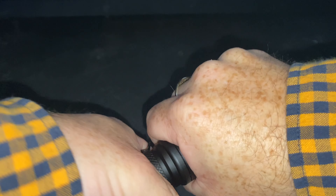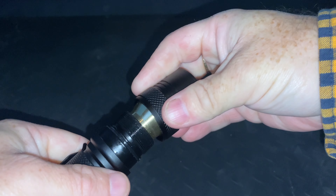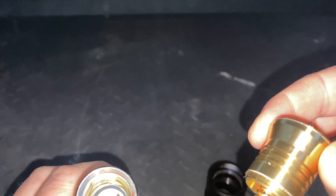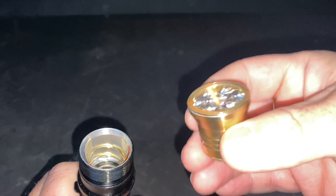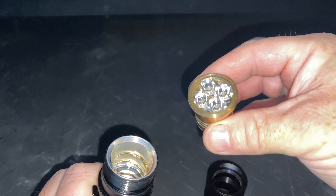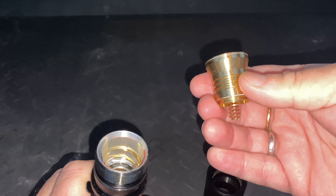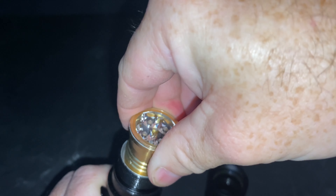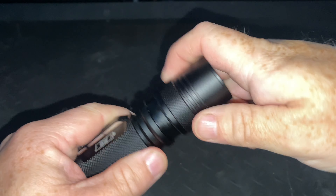Let's unscrew the head on this one. Because it's a quad optic — and I assume their triple would be built very similarly — instead of having a separate reflector, you can see it's actually a brass module. There is a spring in there as well. This is quite chunky; there's quite a lot of mass to it — I'll put it on the scales and include figures in the video. I think that's going to soak up a bit of heat itself. It has got some cooling fins on there as well, and with the extra bit of foil from the aluminium drinks can, it should have pretty good heat transfer.